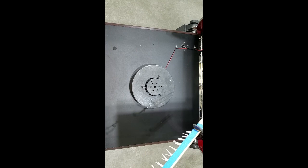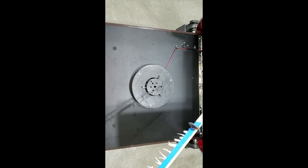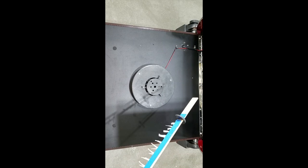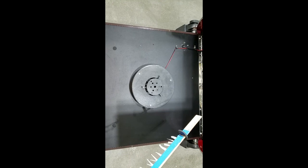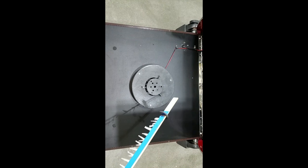Time restricts a deep dive into the insulated properties of glass and the nonlinear transfer of heat versus velocity. But during testing of the system, a 100-millimeter fan was mounted in a typical fashion behind a 24-inch blank, and the velocity was measured — it turned out to be greater than an 8-to-1 difference in speed of air from the edge of the fan to the edge of the mirror. Note that some configurations may not require a diffuser or even a plenum to accomplish this task.